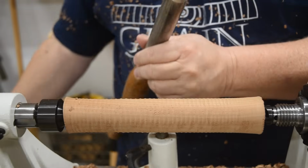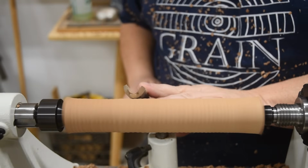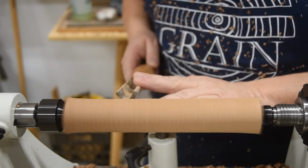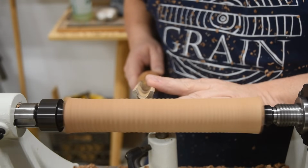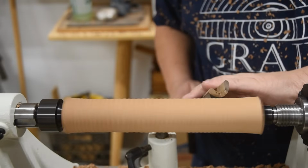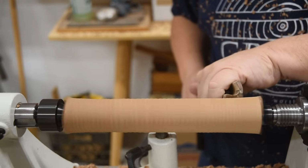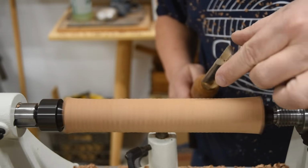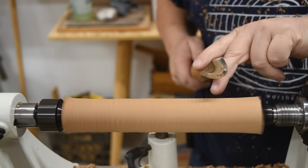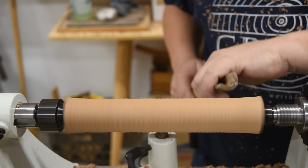So we've got this ugly piece of wood, and until now, I've been taking my tool, touching it to the tool rest, lifting up, and just going that center section, going back and forth really fast. Now, I'm going to do the same exact thing, except I'm going to turn my tool over onto that side, which the wood won't know the difference, but it is engaging a little bit more of the edge, whereas that right there is just doing that small little U.